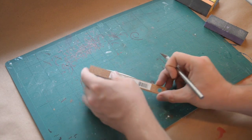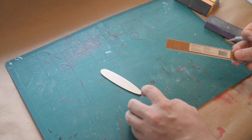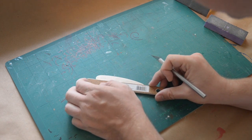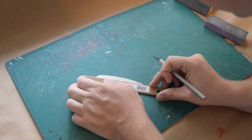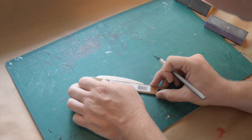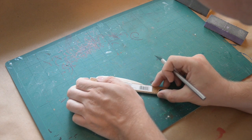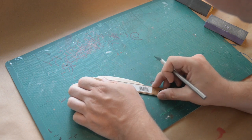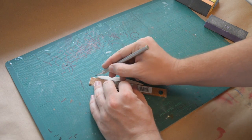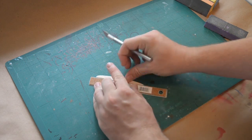Now it's time to cut the surfboard. You're going to cut it into 3 strips here, and this will allow you to have that center strip that you can stain and then glue back together. You're going to want to be pretty careful here as you're doing this, because this is where you can mess up. But if we have our marks on here correct, then we should be able to just put this on here at our marks, hold it nice and tight, and make our first cut.